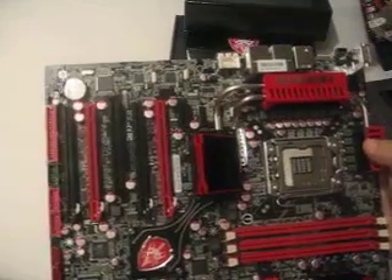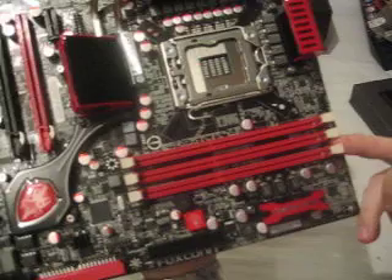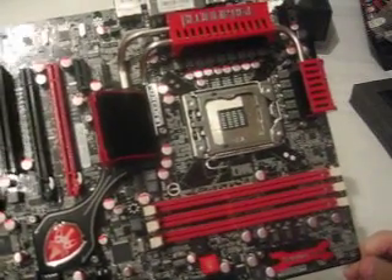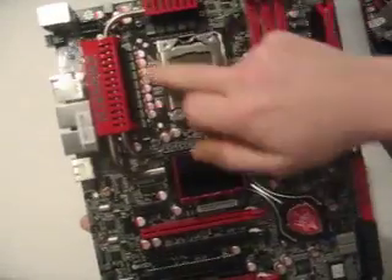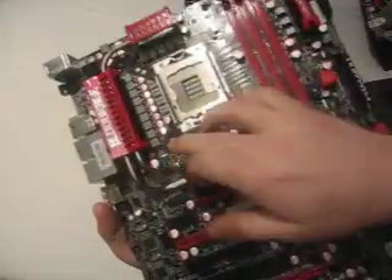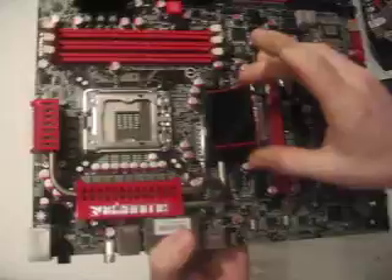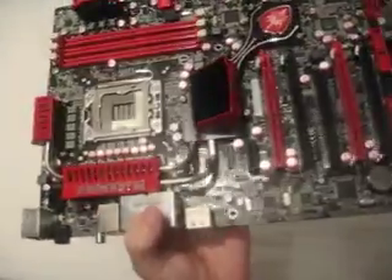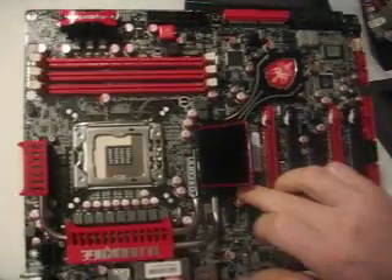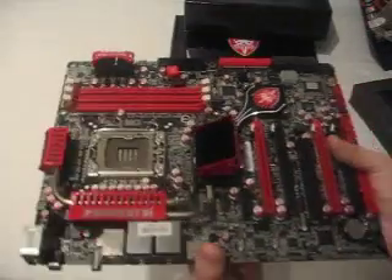Hopefully this video will be alright, but there are also high quality photos going up on Benchtec, so if you can't see anything, have a look at those. What we've got here: triple channel DDR3 RAM supporting up to 12GB of DDR3 memory. There's also a 14-phase hybrid PWM circuitry for power regulation to the CPU — something Foxconn is highlighting quite well. The IOH (Input-Output Hub, what used to be called the Northbridge) has a two-phase power supply, and the DDR3 RAM has a three-phase power supply, all meant to help with overclocking and power regulation.